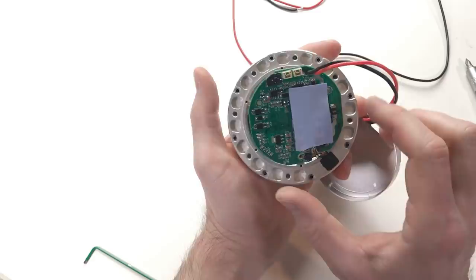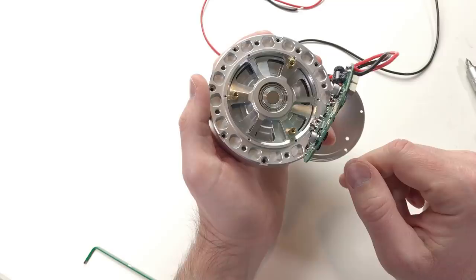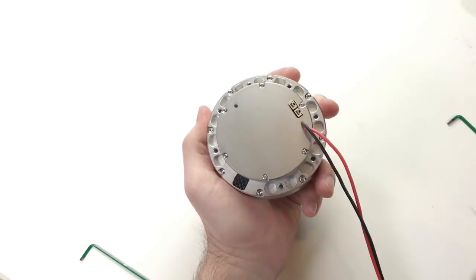At least we saw some parts. We saw the motor itself. We saw that there is a temperature sensor which goes to the motor. And we saw that, again, the encoder is only on the motor. There is no encoder on the output shaft. And to put everything back is very easy. It's like this. Done. So today we looked inside these actuators.